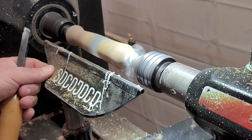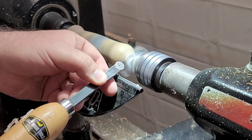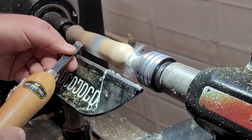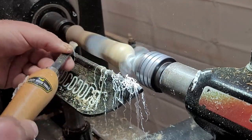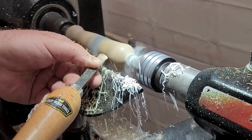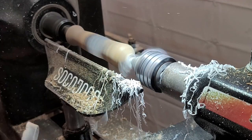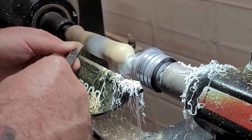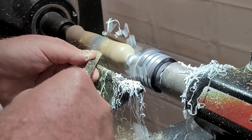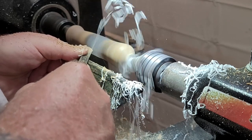This next one is a traditional carbide cutter from the first set I got when I got into woodturning — their mini set. If you put it up on its side at maybe not quite a 45-degree angle and come out of the wood that way, you'll get nice clean ribbons. If you go straight at it you get chatter and chip-out, but I learned that putting it slightly up on its side and angling it is really doing what would be a shear cut with a traditional tool.